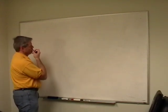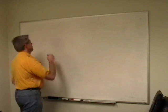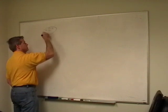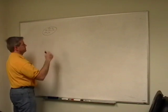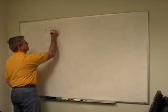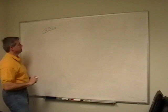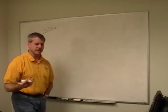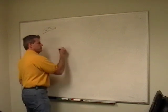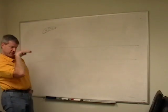So let's say I've got a chip full of inverters, or a wafer. I'm going to go to a semiconductor foundry and I'm going to make a wafer. And on this wafer, there's going to be all these inverters on it. That thing I just drew, two transistors. So let's take a cut right through the middle of this wafer, and let's see what an inverter looks like in there so we can better understand our CMOS process. So I'm going to draw it like this. Where we've cut this wafer, we're looking straight on the end of it.